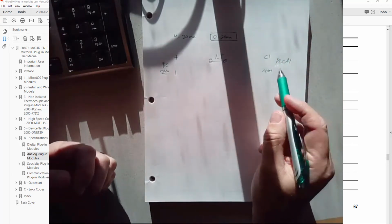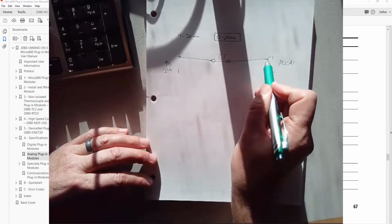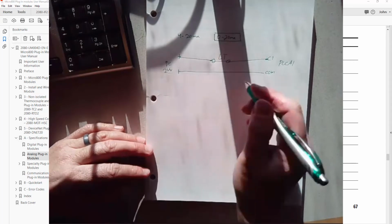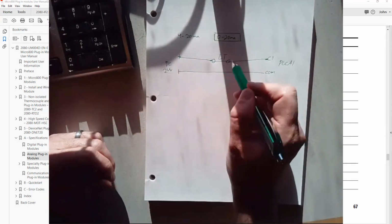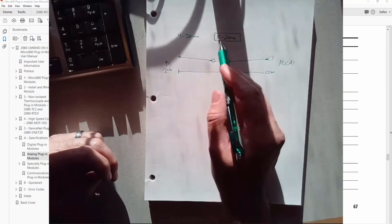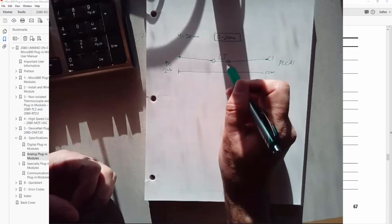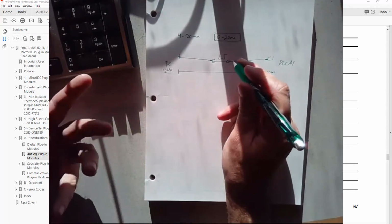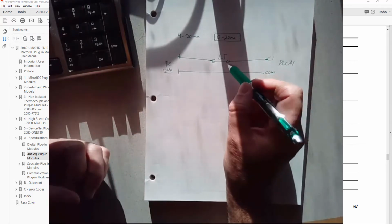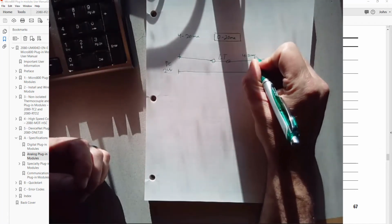That's an analog input. So if we're wiring this input loop, we'd take our positive supply, go to the level transducer, out of the level transducer to the current input of the PLC. The PLC does its measuring internally, and then the loop is completed by returning to the source. So what's happening here is most of these sensors would be loop powered devices. This transmitter is getting its power from the DC supply, and with that voltage applied to it, it then measures its value. If this is a level transmitter, it's measuring either by pressure or some other sensing technology. It's reviewing what is the level of the fluid I'm looking at, and then it varies its own internal resistance to create 4 to 20 milliamps of current on this loop.